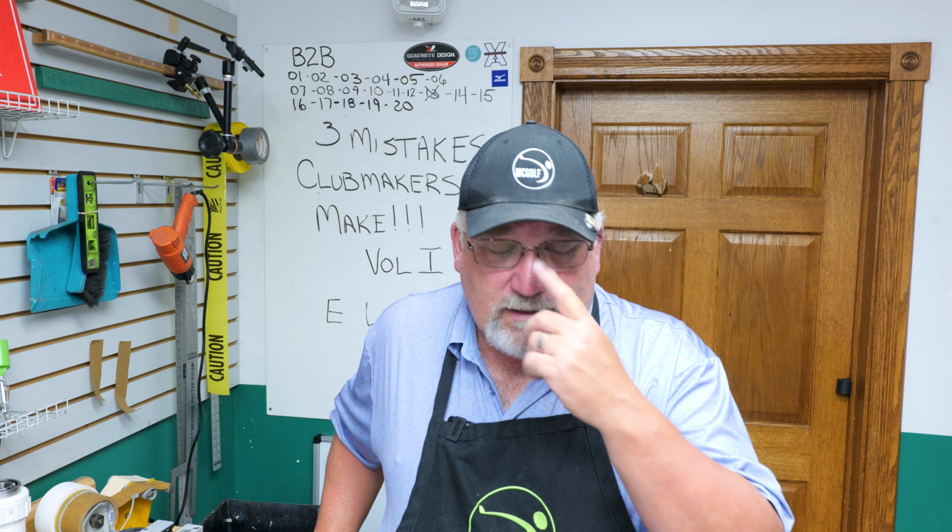All right, so let's talk about epoxies. Epoxies come in a lot of different shapes and sizes and cure times. When I say shapes and sizes, I mean cure times, gel times. So you can get a cure time or a usable time of 5 minutes, 15 minutes, 30 minutes, half a day, 24 hours. It's all based on your needs.